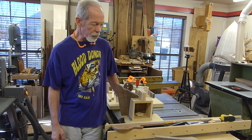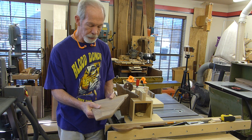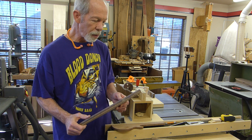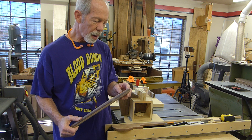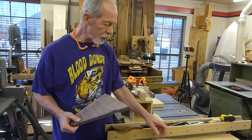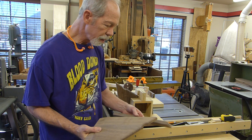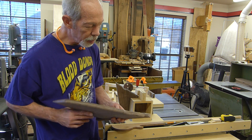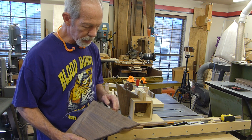So I thought I'd show some of the table saw fixtures I'm making in quantity, and there's a few issues that arise in making these. If you've ever used a router and tried to start on a leading edge, I don't know anybody that wants to stick this point into a spinning router. So when I cut this on the CNC, I cut it to the exact size and then I used a sacrificial piece on each one — I screw this into the bottom, start the router right here, then take it off and put it on the next one. That's not that bad, but it's not ideal.